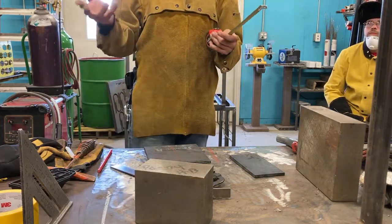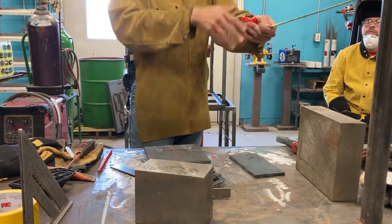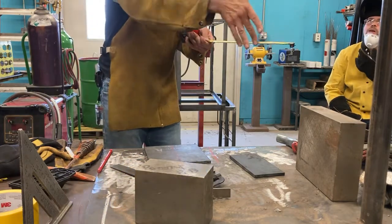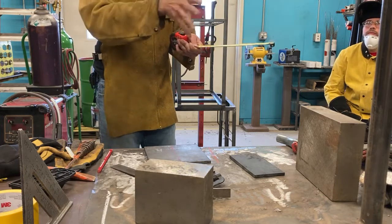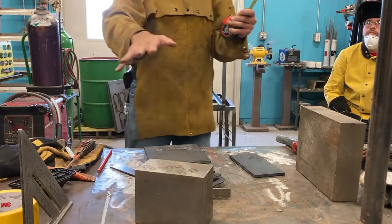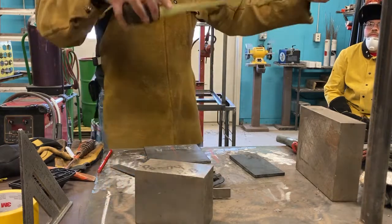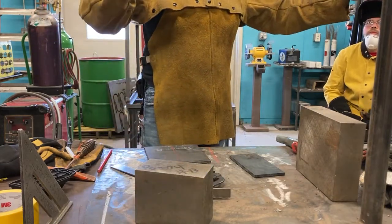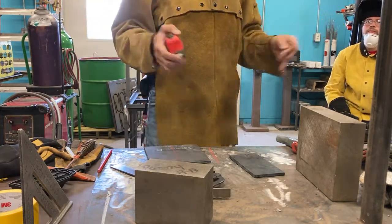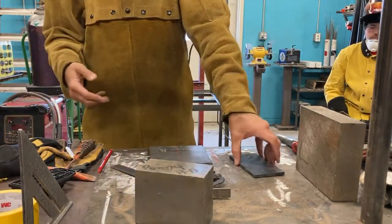This is common from the world of carpentry, and it works the same for metal, and that works well. So you can do very straight lines with this. I mean, I've done 8-foot ones with this. Have one person hold it and pull it tight, and then you run carefully, you can run right along the edge. So you can mark out perfectly square, parallel, perpendicular lines with just a tape measure if you don't have a square, or you have to do a really big measurement. This will help you. I used to have one that was 50 feet long. I have a 100-foot one at home. So for structural, sometimes we have to lay out some very, very large things. So there's a little baby one. So I got my line. Okay, I'm happy, I got my line. Now I got my metal.